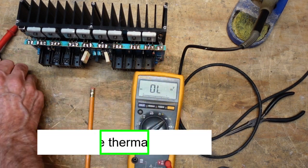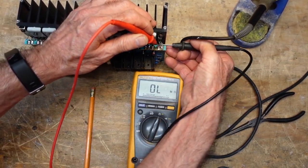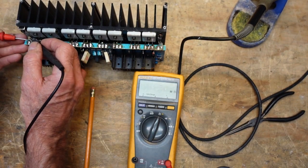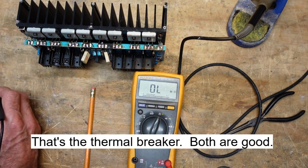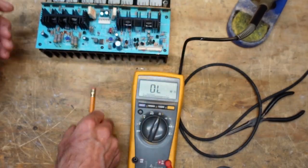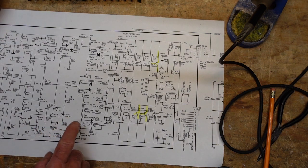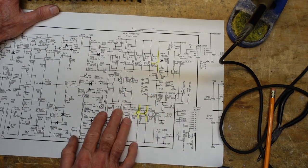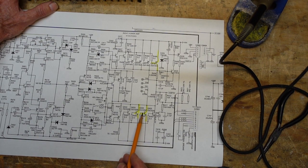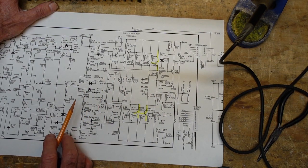At the end here we have what I believe are thermistors. This one reads 50 ohms and it's probably okay, but this one reads zero — I'm going to have to look at the schematic, but one of these is bad. So we know these are bad. I've taken my schematic and with a highlighter I marked the three shorted output transistors we found. The reason we do this is it can, and usually does, lead you to the next bad components — because if a transistor is shorted all three ways, there's a good chance this 2.2 ohm resistor has opened up. So we're going to take a look at those.